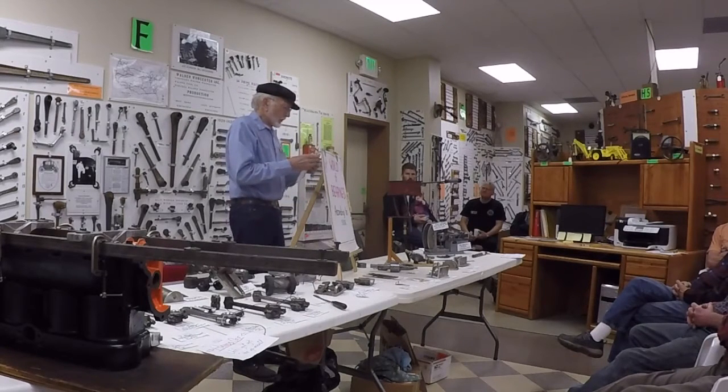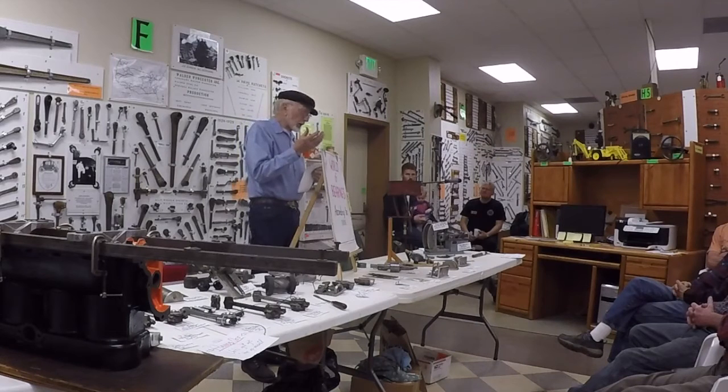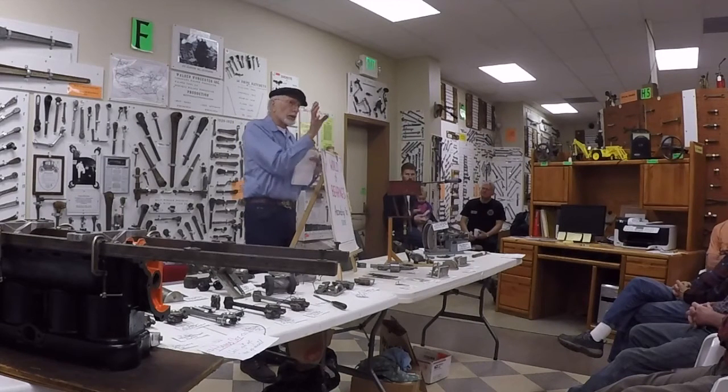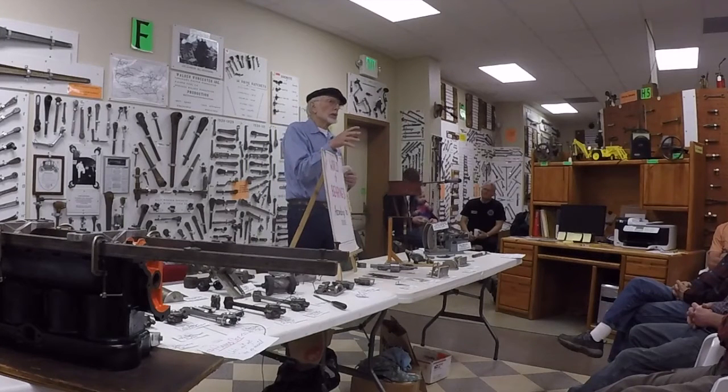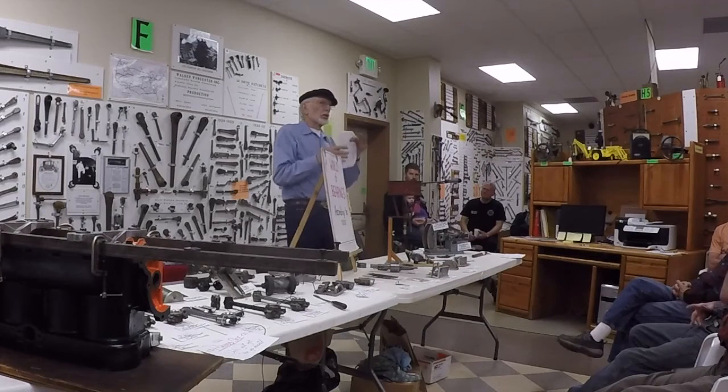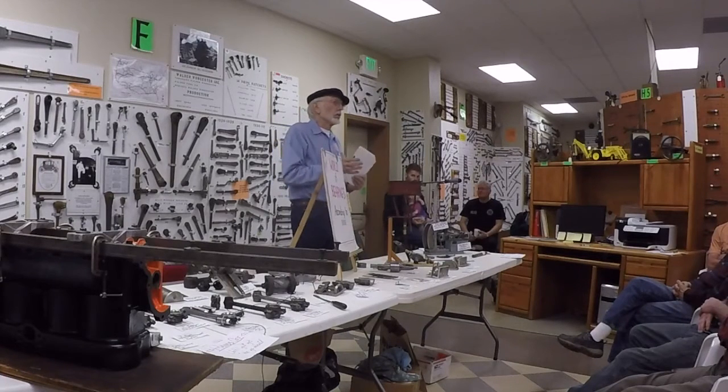So, and of course you got to get the bearing body itself, or the block, that part right at the bearing. You got to get that hot enough to receive the Babbitt. If it's on the cold side, the Babbitt will go down in there and freeze over and you get short shots or gaps, doesn't fill, and then you get to do it over again.